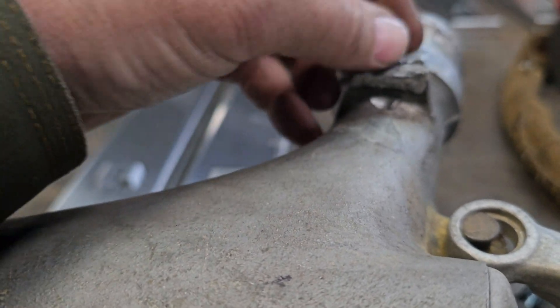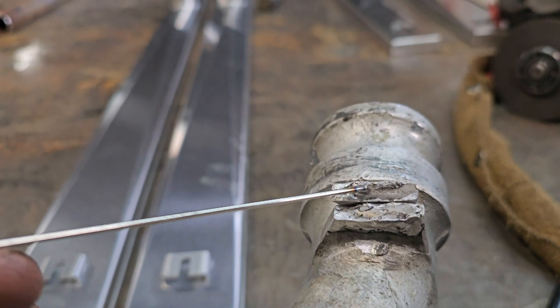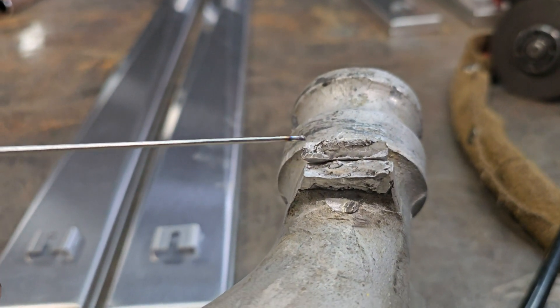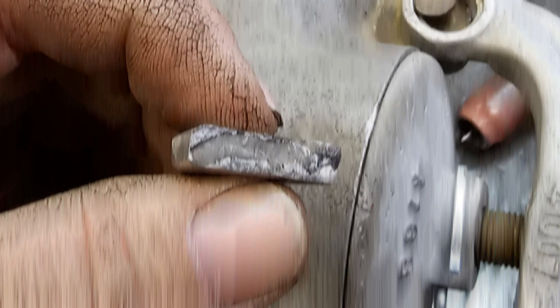As you can see, if you look at the weld here up close, you're going to see that gray area in the middle. That is the original crack that was never welded. You can see it on both sides. Here's an up-close picture of the fracture site — you can see the gray area, that's the original crack, and the silver is the penetration that the welder got when he stuck the two pieces back together and ground his weld off. So that was the only thing holding this on to the crop duster.